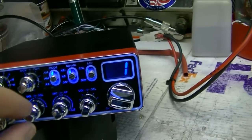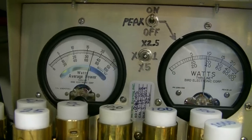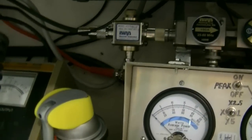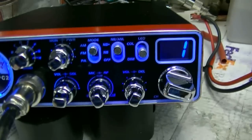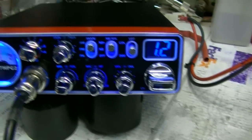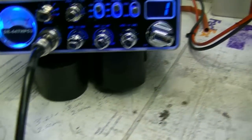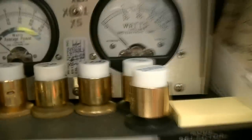What are we dead-keying in FM? In FM we're dead-keying about 70 watts — that's kind of high, so we're going to need to turn that down a little bit. Back to AM mode. All the controls are pretty much self-explanatory. Looks like it goes from 28 megahertz up to 29.6 — nice, it covers the full spectrum. Let's see what the power looks like up here — AM, we're still doing about 30 watts. Audio — a little over 100 peak.